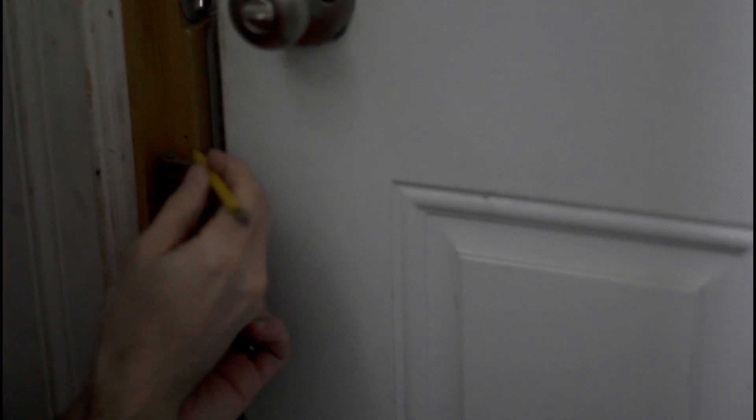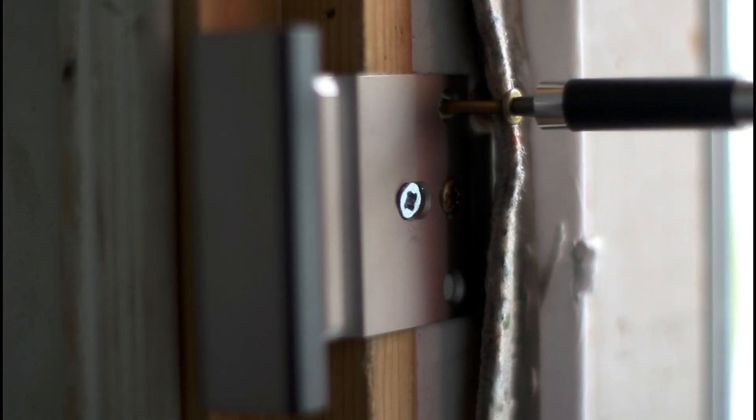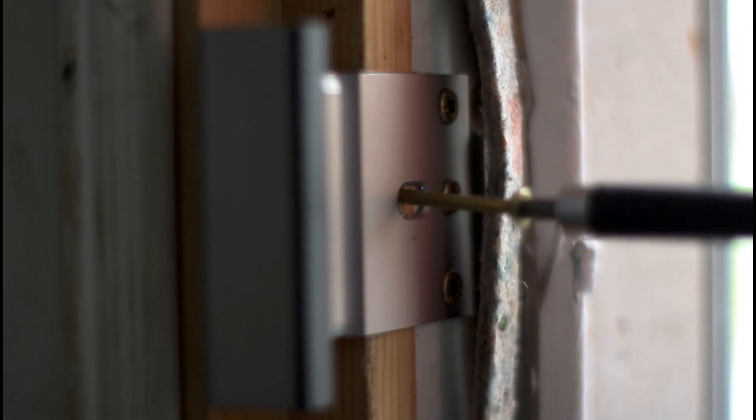All you have to do for a normal installation is put the door latch inside the door, in between the door and the frame, to make sure there's enough room — just in case you have to notch it out a little bit to recess that door latch in there. Once you have it in the proper location, mark it with a pencil. Then open your door and take that little tiny screw and just screw it into the adjusting plate. Once you have that in there and you adjust everything, close the door, dry fit it, and make sure that door latch is going to sit just where you want it. Then go ahead and drill the three-inch long screws through the door frame into the stud. Optionally, you can take that little screw back out and throw another three-inch long screw in there to get just another screw going through the door frame into the stud.